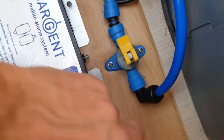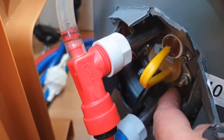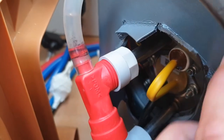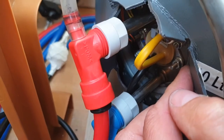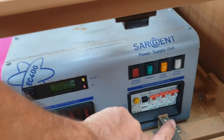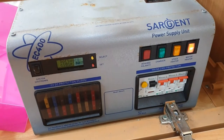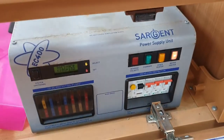Moment of truth - close the dump valve, prime it all with water, and check for leaks. Where it goes into the tank - that's dry. These fittings you've taken off - dry. Cold feed - lovely and dry. I've already primed the water so the tank's full. Now down to the fuse board - main fuse on water heater.